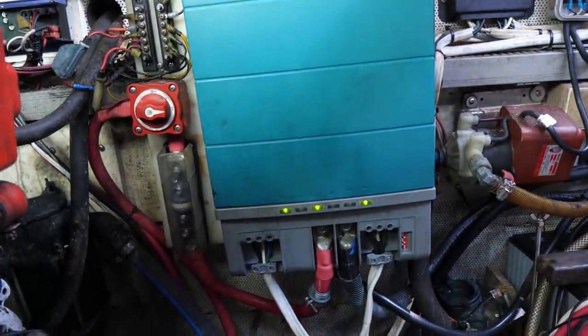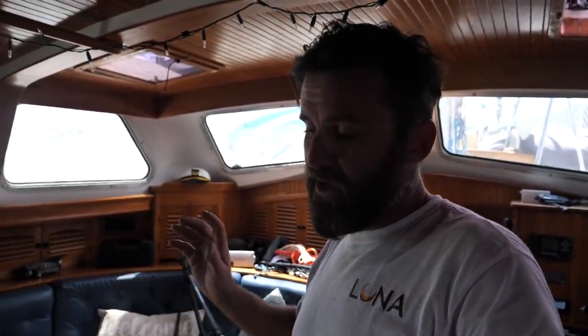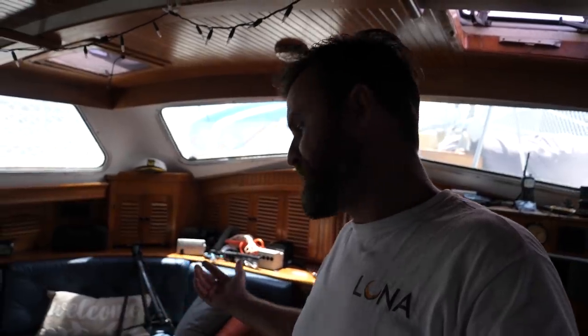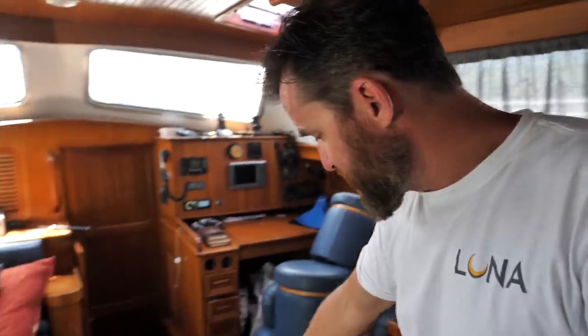You need a way to use your power and a way to charge your battery. You need an inverter charger on your sailboat — it inverts 12-volt DC to 110-volt AC so you can plug stuff in like your computer. A lot of equipment on the boat runs on 12 volts, but household-type stuff needs the inverter. Ours is a 2,000-watt inverter charger, costing around $1,200 to $1,500. It also charges the batteries from shore power, converting it to DC — just like an RV plugging in.